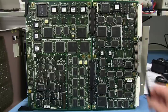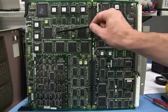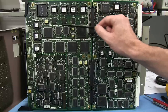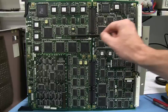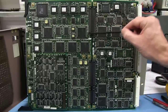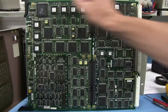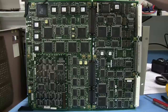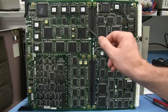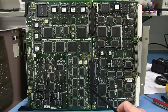But the good thing here is that they've actually separated, as before, all the silkscreen stuff. So this is the Z process part of it. Actually, it looks like only two Sony branded chips in there for the Z process. This is the multiply and add, so just doing multiplication and adding. This is the CPU up here. They've got another one of these IDT 32-bit processors up here with the ROMs here, and another couple of Altera CPLDs.